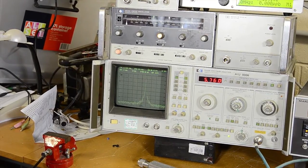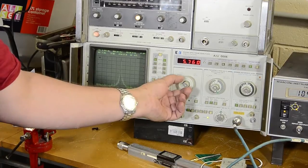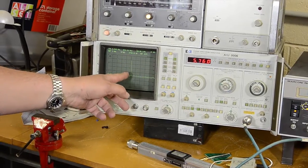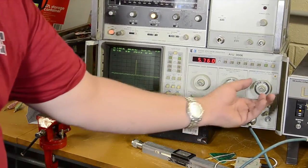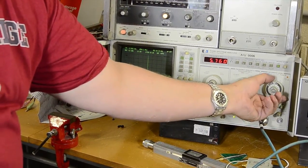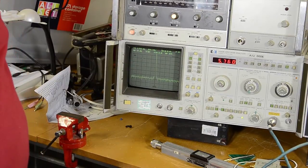Starting from the left, the controls are the tuning control, which moves the display left to right — much like the time base on a scope. This is the bandwidth control, so I can go in and look at all the spectrum — that's 50 MHz from here to here, which is quite a small slice. And this is the attenuator. You have to be careful not to put too much signal into these things, otherwise you'll blow them up. That allows you to change the height — adding more attenuation brings the signal down. Other than that it's a very basic device — 1980s vintage, so it's very easy to drive for home use.